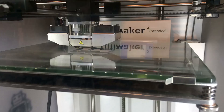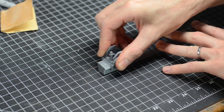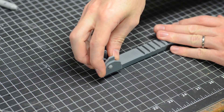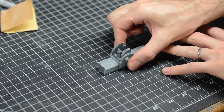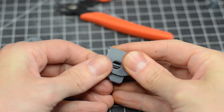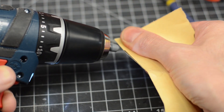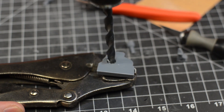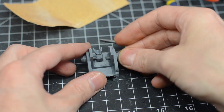I also printed out the front scope assembly and the rails for the scopes. I actually modeled this rail to the same dimensions as a Picatinny rail — that's the same standard rail used on many real guns. This way if I wanted to I could totally buy an off-the-shelf scope and put it on my gun. The scope was modeled in four pieces; I figured this was the best way to get all the parts to print as nicely as possible. Once printed, I separated the parts from the raft and support material and cleaned them up. The pegs were put into my power drill and spun against a file and then sandpaper to tidy them up. I also had to drill out the holes a little bit, and I quickly learned I should have held the piece with something other than my hands, because twist drills will bite into PLA like nobody's business and send that part spinning. Once prepared I was able to put all the pieces together very nicely and had my front scope ready to go.